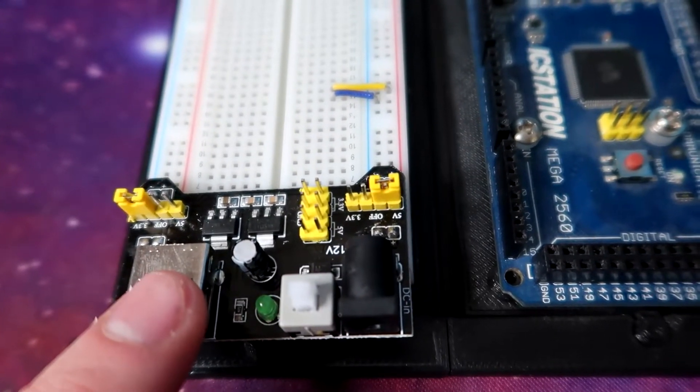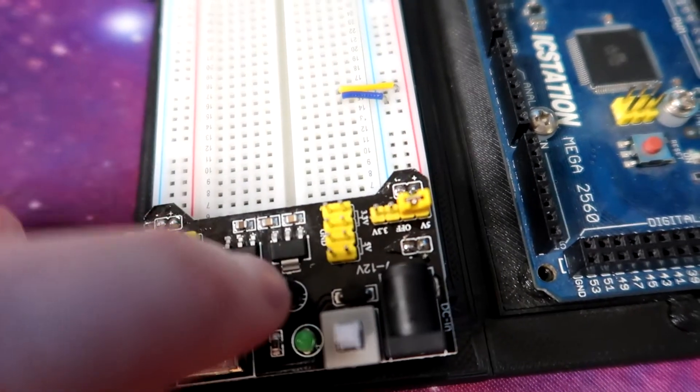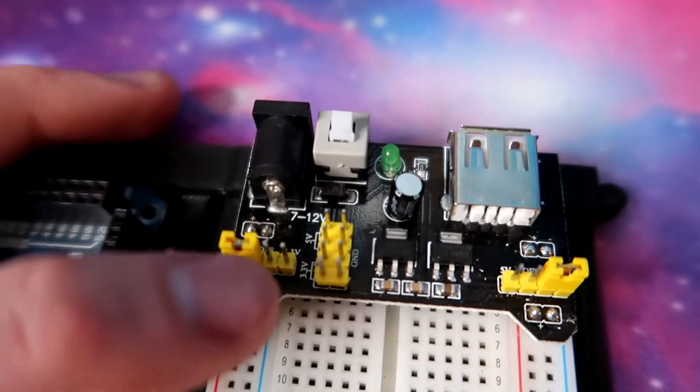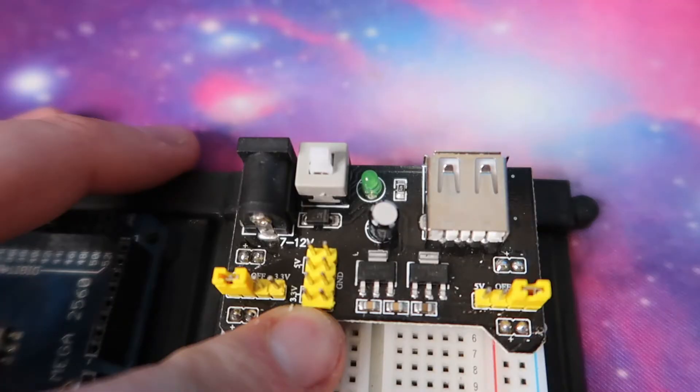We have that DC jack and the USB connection, the power on/off switch which powers the DC plug in through the LED, and a bunch of electronic components which change the voltage levels and control everything. That brings us to our first block of eight pins, where we can actually run off to — say, a fan, a relay, or another device. Instead of running power down the rails of the breadboard, you've got these extra set of connectors. The positive is on the left-hand side and the ground rail is on the right.